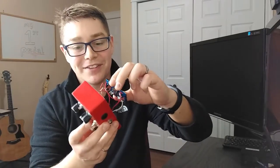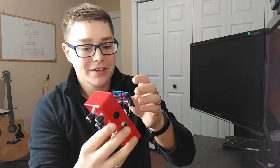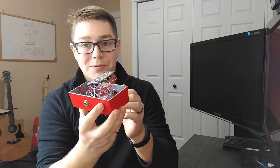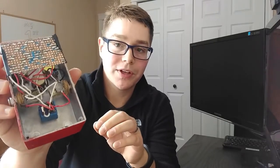Pulling this out, the first thing I can say is look how much wire is in there — quite a bit for a small board like this. Also, none of my wire is really color coded. I see a couple blacks in there maybe for ground, but for the most part it's just red and white. Definitely something I've changed over the years — now red is for 9 volts, white or green for input, yellow for output, and black for ground. This is also before I used 3PDT switching PCBs that I order from RuliWOW or Pedal PCB. So this is all hand-wired on the 3PDT switch. I could still do it this way, but it saves a lot of time the other way and you don't have to worry about shorts as much.